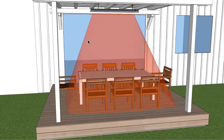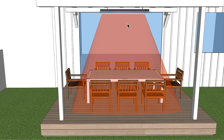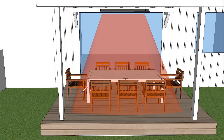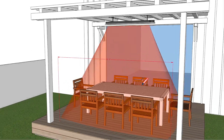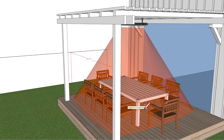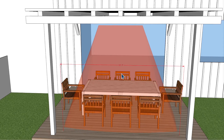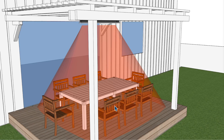Essentially, with this mounting height, what I wanted to show is kind of what a footprint of heat would look like — showing the distance of the ray itself. You can see here we're at about 10 feet 3 inches on that distance. So if the table is a lot shorter than what I'm showing, then it might be okay, but it's still not my preference as far as the footprint. It does warm up these positions okay.